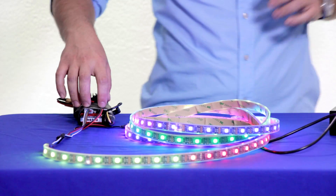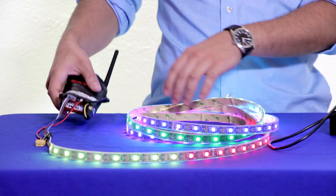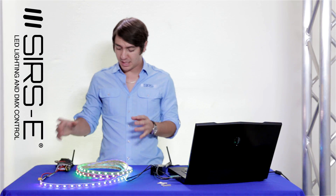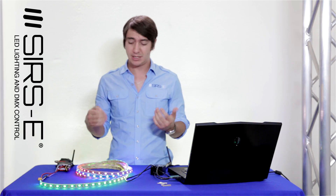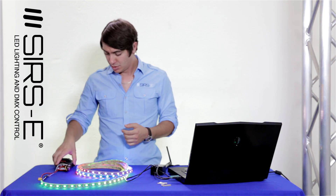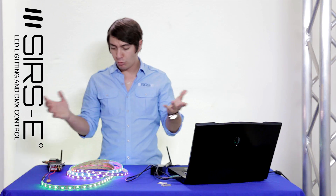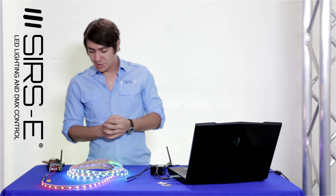The main thing to keep track of is your battery. There is no low voltage cut-off in this circuit setup, although I will be coming out with one that will protect your battery. With LiPo batteries you don't want to drain them all the way down or you'll ruin them — and that's a 50, 60, 70, 80 dollar battery you don't want to lose. As you can see it runs really smooth, completely wireless. You can set this up at a party or anywhere you need wireless DMX and power.